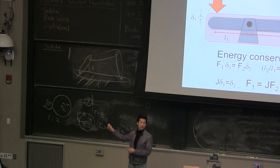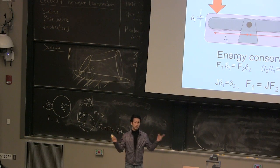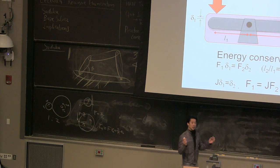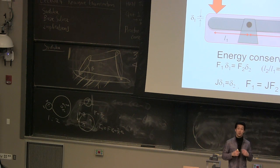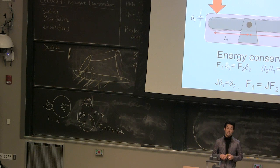In this case, it doesn't need to be a small movement, right? Because the ratio is constant, no matter how much you move, your ratio doesn't change. When it comes to a four-bar linkage and other mechanisms, those numbers are constantly changing as well. So that's why we're talking about virtual work, very small movements, and then instantaneous velocity. Does it make sense? Any questions?